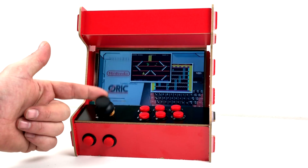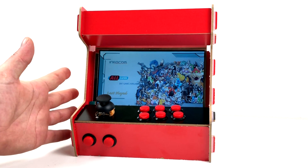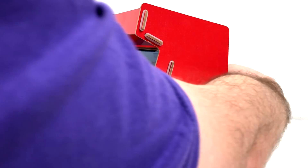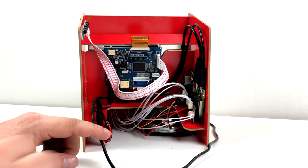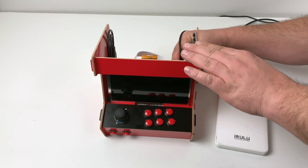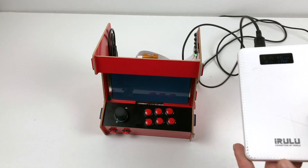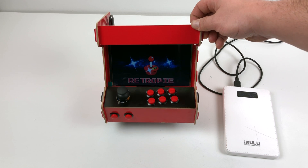Overall, I think this is a really cool little project. I'll leave links in the description if you want to get started on ordering everything. It does require a bit of soldering — you have to solder the GPIO adapter onto the arcade bonnet so you can slide it onto your Raspberry Pi 3 or Raspberry Pi 3 B Plus. I didn't want to go with micro USB to power this whole thing, so I'm using a four amp power supply with a 2.5 millimeter barrel jack. Since the screen and the Raspberry Pi run on five volts, you can use a battery bank to power this. The screen comes with a barrel jack to USB adapter, so you can power this whole thing with a battery bank. This one puts out three amps, which is sufficient for the screen and the Pi.